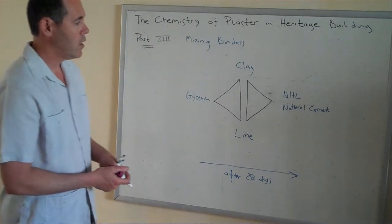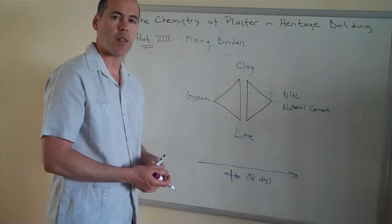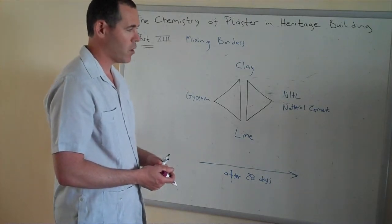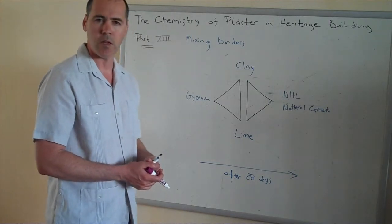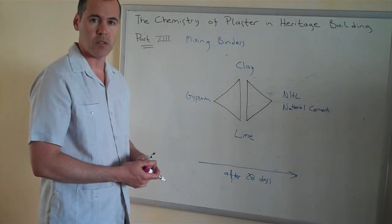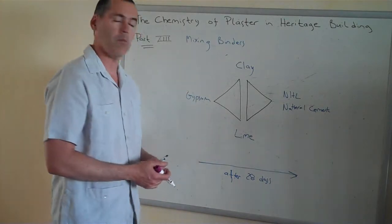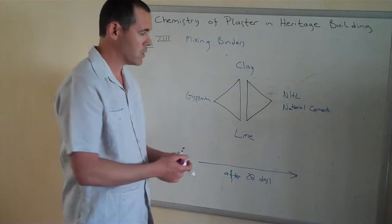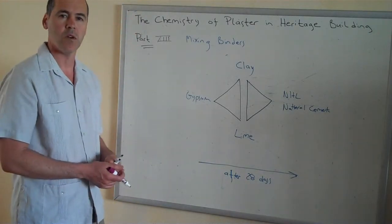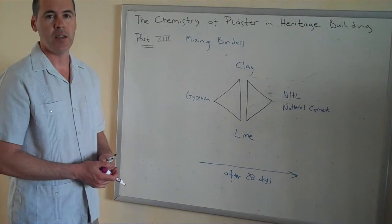And then for the natural hydraulic limes, it's very common to also add lime when you are looking for more flexural strength. Compressive strength is not quite as important, particularly in a lot of heritage work. Perhaps the compressive strength is a little bit too high for the existing soft masonry. It's not a problem. Mix it with lime. There are good guidelines for what that will do as far as compressive strength, and that way you can hit the number that you need to. Same goes if you need to increase the compressive strength of a natural hydraulic lime or get a greater frost resistance: you can add some natural cement to it as well. So with a little bit of knowledge, a little bit of technical support from responsible manufacturers, you can work with all these materials together, as was classically done in the past for hundreds of years.